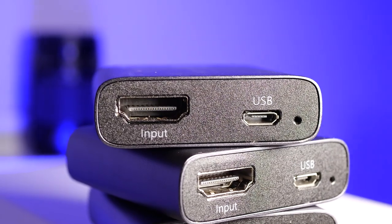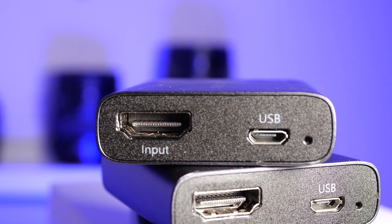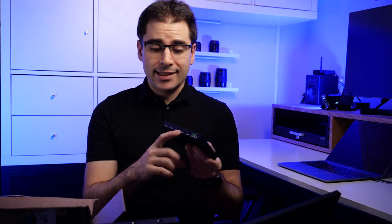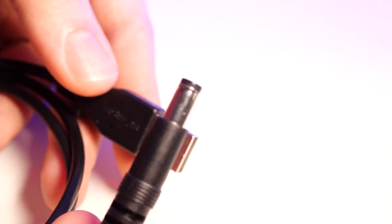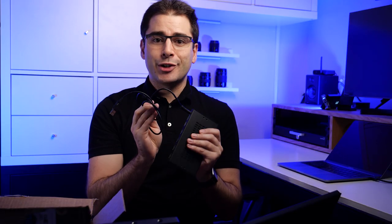So this is going to be our power supply, meaning I only have to use one AC power and I don't have any power bricks. These little HDMI splitters are actually USB powered — they have a micro USB port on the back, which makes cables a lot easier to deal with. The trick is that while this multi-viewer does take five volts in, it has a DC barrel jack. So you're also going to need one of these, which has a USB on one side and a DC barrel jack on the other, so it can be powered over USB.